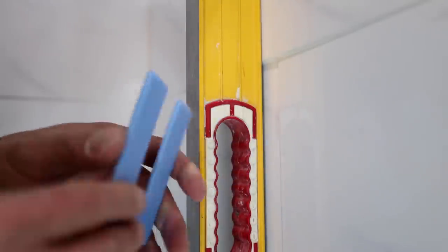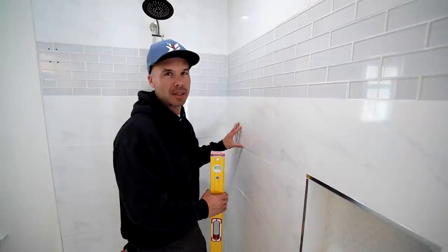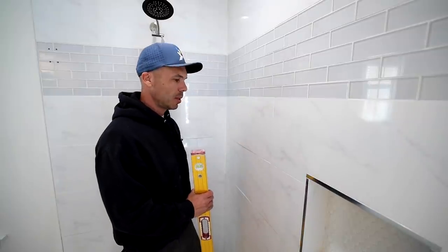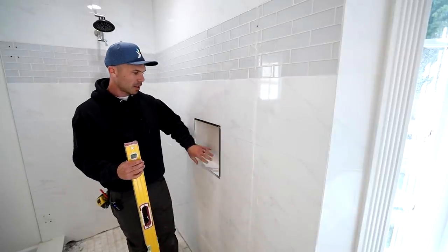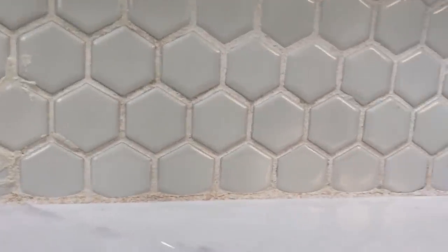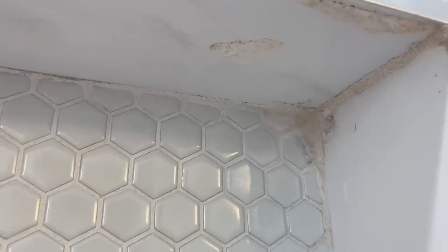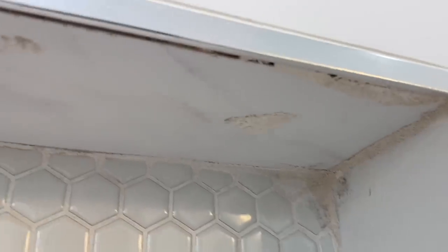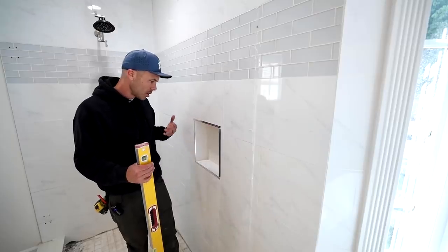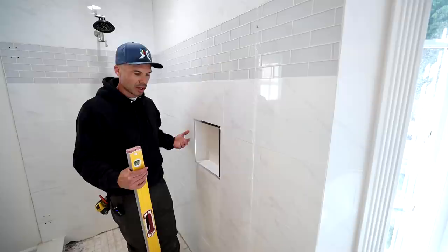The niche here was done with some little hexagon sheet mosaic tiles. I was checking it out and looked underneath — there's still some grout that never got cleaned off the tiles. They completely missed one of the grout joints on the underneath front edge. I could just tell that this was overall a poorly done tile job.